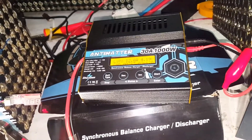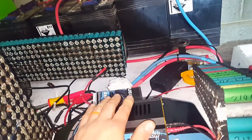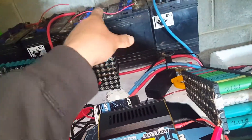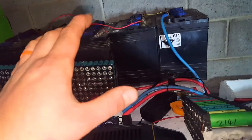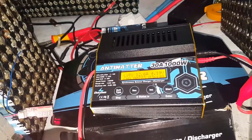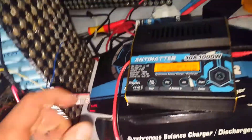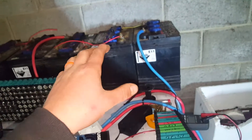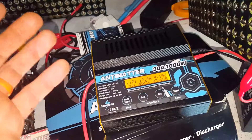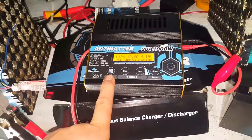There's a good chance a lot of the time I'll be using this to charge up these if the UPSs aren't on them. But with this I'll actually be able to discharge the three batteries I've had on my UPSs and get a capacity rating. I'll get an almost flat car battery, connect these leads to it in regenerative discharge mode, suck the power out, and it will tell me how much power they've got while charging the car battery at the same time — so I'm not just burning off energy as heat for no reason. This is a huge feature and another great reason to buy one of these.